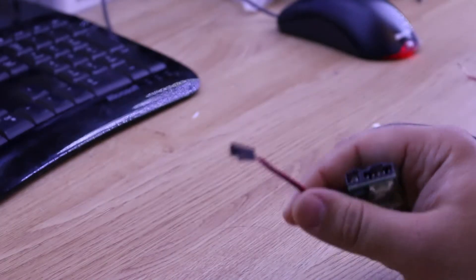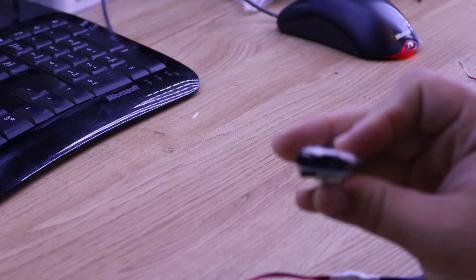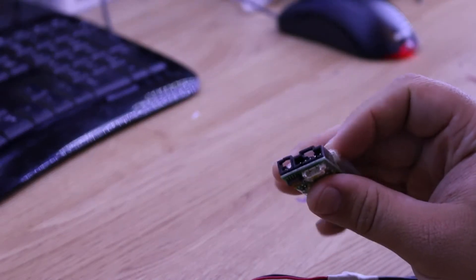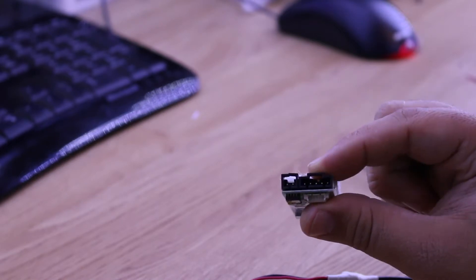Now, to find the plug you've first got to know what the plug and connector series are. And if this looks a little bit familiar to you — which it may well do if you played around with computers in the 90s — it's the same kind of connector that they used to route audio out of the back of CD drives. This led me to discover that this is actually a Molex SL series connector and plug set.